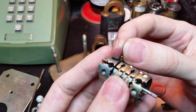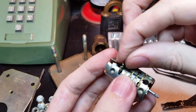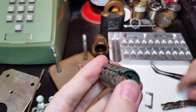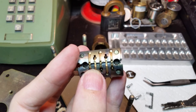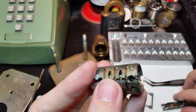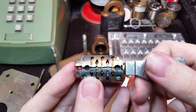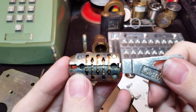So that is the whole thing. These were rather popular up until the 70s and early 80s, when people in New York particularly were very concerned about the security of their doors. Unfortunately, it was discovered that the fit and finish of these parts is so tight that just blowing some dirt or metal filings in there along with a little bit of glue or heavy oil would cause this whole thing to seize up and stop operating, which is not great for reliability. If you're really interested in these, there's not a lot written about them in English. Schuyler Towne has a really great video — I'll add a link to that in the description. Otherwise, you're going to have to hope you have decent working knowledge of French.